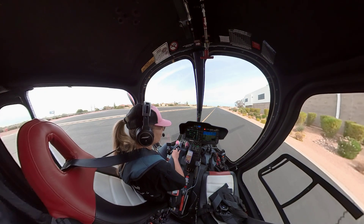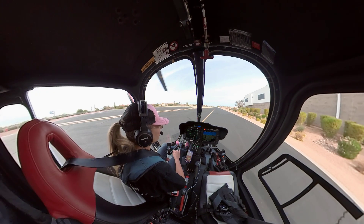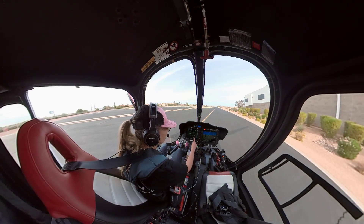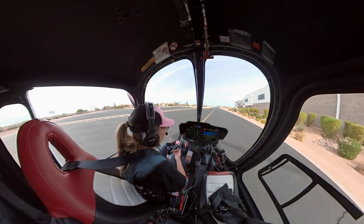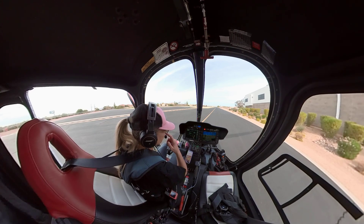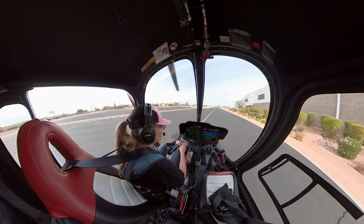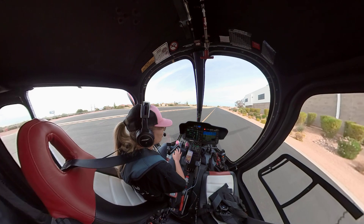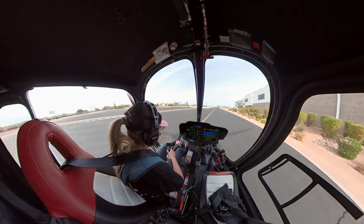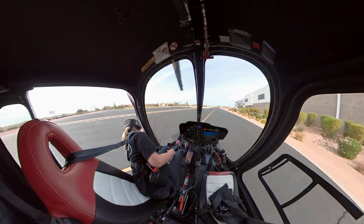NR gets to 62, 63. When it's stable at 64, I'll turn on the generator. It's really good habit to note your amperage — it draws 40. This helicopter with this configuration always does. As soon as I turn on the AC, it'll be another 10 to 15. I'm green everywhere except engine temperature. If it's above 10, I can go straight to fly, which it is.